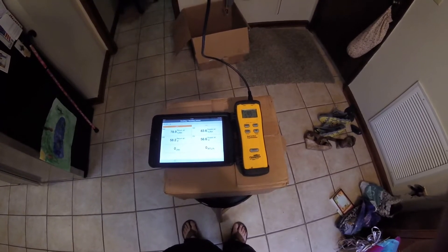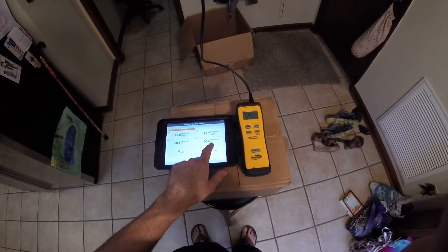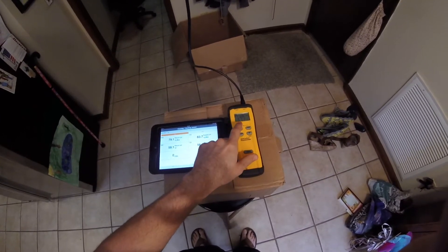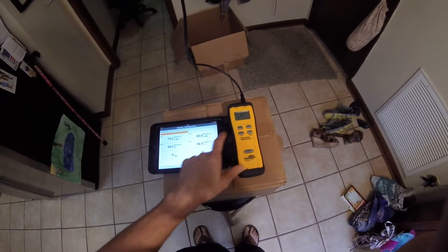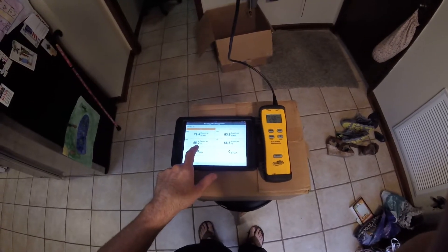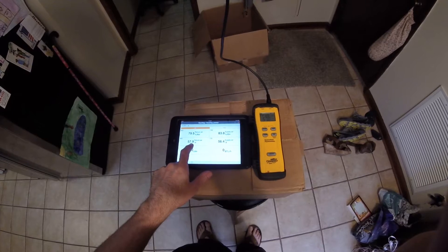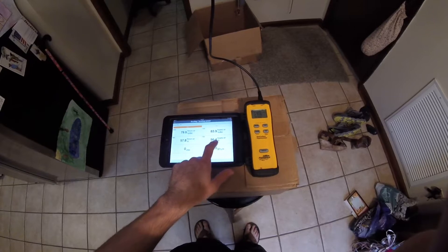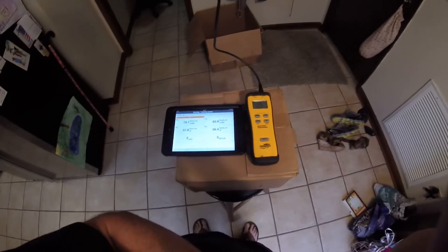This is at about the five-minute mark where the readings have slowed down. As you can see, from the discharge of the air handler directly in the supply plenum right above the blower, to inside the flex in this grill, only about a half a degree. But then at the grill, it looks like we've got about another degree, because this pretty much tracks my supply air pretty closely.